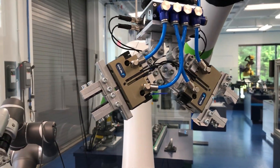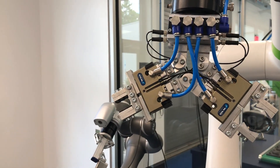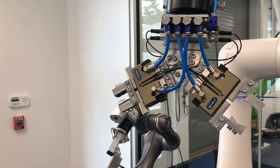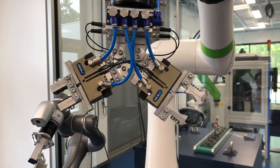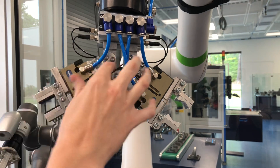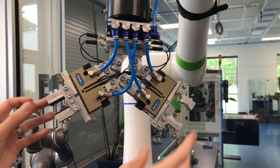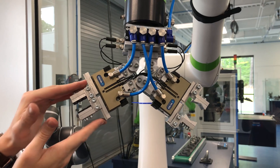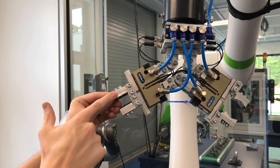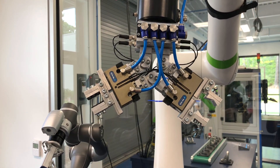You're doing CNC machine tending or even lathe tending — you want to reach in the side and pick up that cylindrical billet. What's cool about Flexgrip Tools is we have them in a bunch of different sized grippers. We have four or five different size two-jaw grippers, a couple different three-jaw size grippers, and electric grippers in this series. It uses all these modular connections so we can actually adjust the angle in and out. We make fingers that are standard components, and you can adjust the grip position on the base jaws. We've got rubber padded fingers, a flat metal finger, and our dual V-jaw finger so you can pick up cylindrical parts either axially or radially.